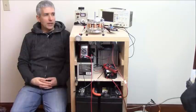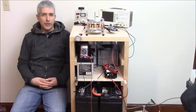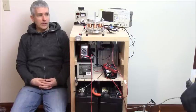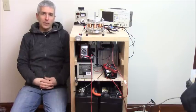Easily can run at 100 watts per 12 volt division of batteries input. So you can do 100, 200, 300, 400. But I've never really set it up to run 36, 48 volts. We've run it up into the hundreds of volts, over 100 volts, and it works really well, but we have to really limit the on time. And that's exactly what we want to do.